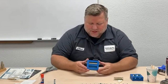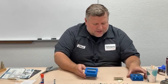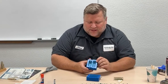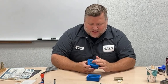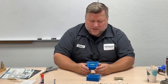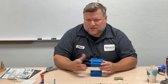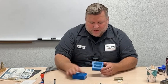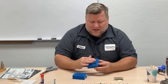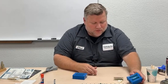Good question. So once you've got this floating, you can do one side or the other. Sometimes there's a little spillway in something like this. The main reason, I would guess, is because you always cast a top and a bottom for this kind of pen because it requires two pieces. But a monarch or a bolt action, you can cast one or both. Even this, you could cast both, but you would have to put plugs in the other side and fill it all the way up. So you are wasting one side if you just did one in that kind of a mold.